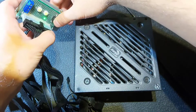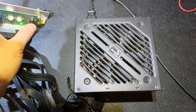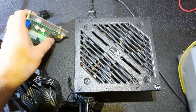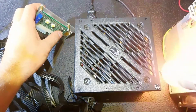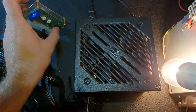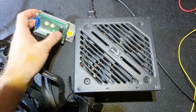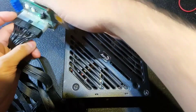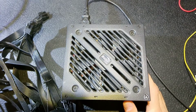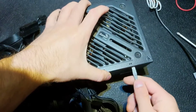As you can see, the PS ON light is present, which is good, but the power supply itself is not turning on. The safety lamp which is connected in series lights up, so definitely we have a problem, probably on the primary side. There is an indication that there is a short somewhere.